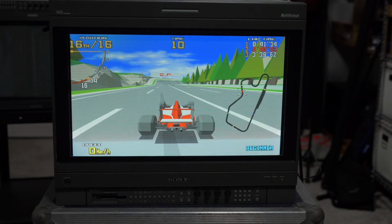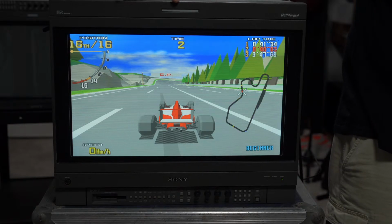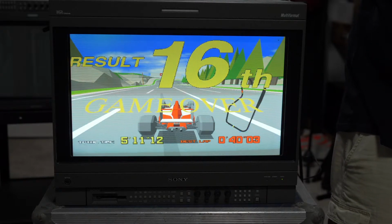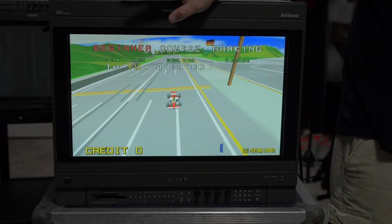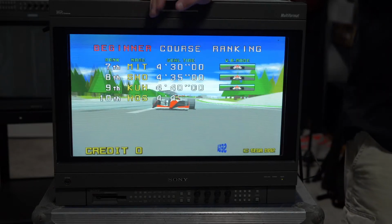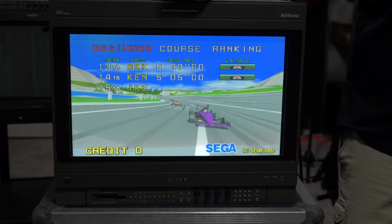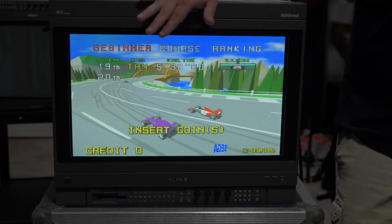Ryan, if you had to choose between a BVM-20G1E or a BVM-D24, get the 24 because it's for the same price. The 24 is multi-sync, so it could do 240p, 480i, 480p, 720p, 1080i, maybe a lower PC resolution in there. Whereas the 20G series has quote unquote only 600 TVL. So I actually prefer it, because it has all of the calibration and sharpness advantages of a BVM, but you could see the mask more. But it's only a 15 kilohertz monitor. So unless the 20G was brand new or something, this is going to give you way more for your money.